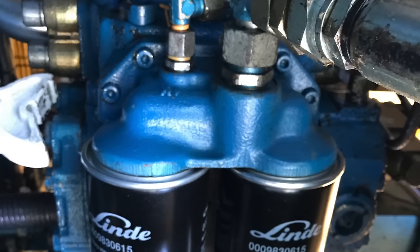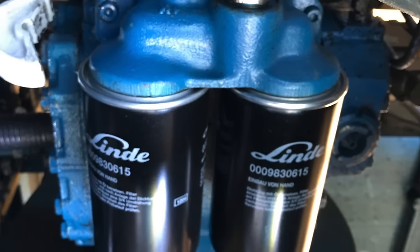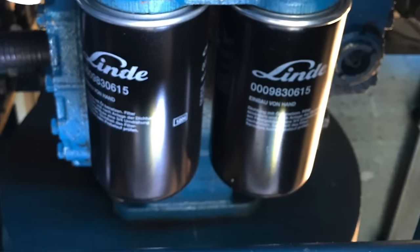But let's see, you got lift one, lift two, cable, hydraulic system, not much there. Flush and refill the oil, change the filters. It's got about, I think, 6 filters in there. The hydraulic accumulator on lift two had to get changed every year.